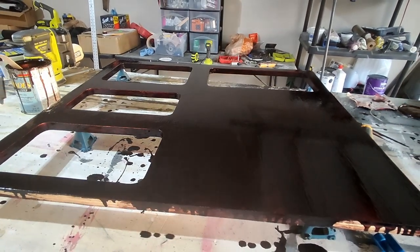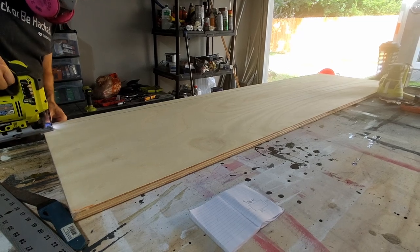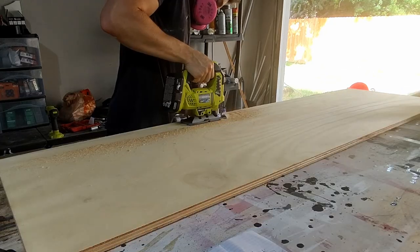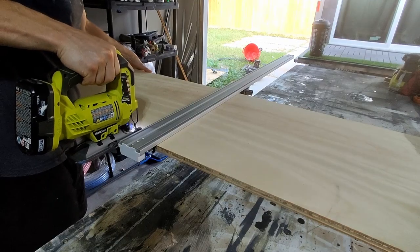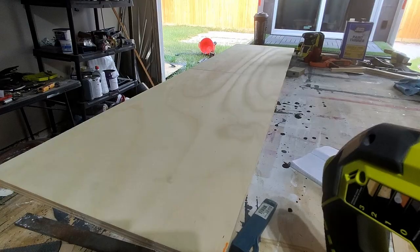It's 3 layers of poly shades. I had to sand it off. Recoat it again the proper way by doing 1 thin layer and then steel wool and then another thin layer, and that eventually got me to the final product. So just a fair warning for you guys, if you want to use the poly shades, don't do what you see me do right there and just slather it on.